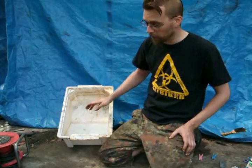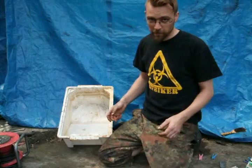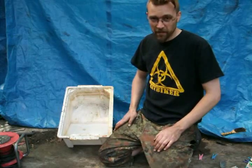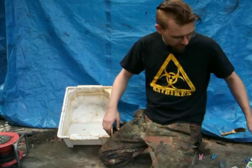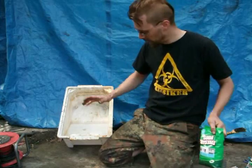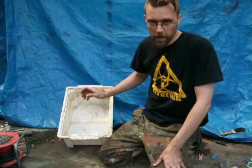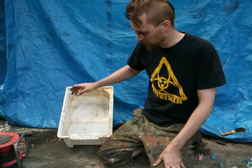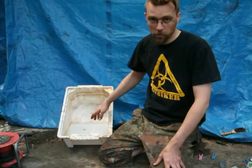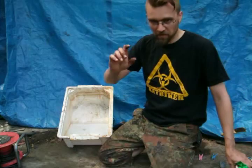It's not warm. A lot of people go on about needing hot water to dissolve the soda crystals, but I've been doing it ages and I don't use hot water. The amount of water you use doesn't really matter — it's got to be enough to cover whatever you want to get the rust off. The rust will only come off what's in the water. If it's not underwater, it ain't going to work.